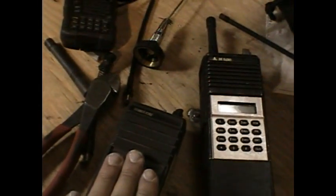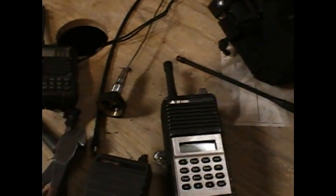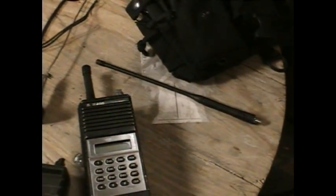For tactical communications — portable to portable — that would be the ideal setup. Tactical frequencies are an actual term used in public safety: you're communicating with another group, division, or team. A command frequency would use a repeater — either a portable repeater set up on a hilltop or an actual fixed-site repeater. That command repeater allows upper command to get intel from the field and disseminate instructions over a longer distance. You can also use the command repeater as a tactical channel for longer ranges.